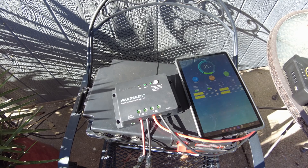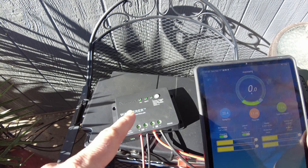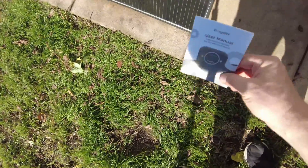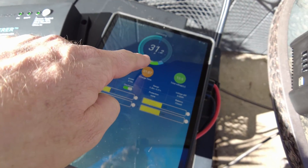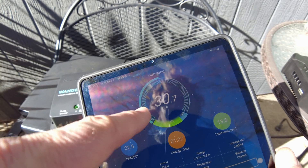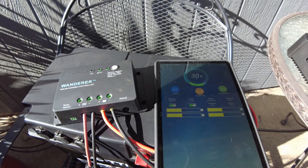After letting it run for a little while, we went down to zero amps — it hit the same wall where too much power from the PV causes it to throttle down. Now it's coming back up. I shaded one little portion, cutting power to 31 amps, then shaded a bit more to get down to 30 amps. We let it run and we have not throttled at all — as long as we stay around 30 amps, it's all good. Switching back to the Bouge RV, we got 30.8 amps and it can hang.